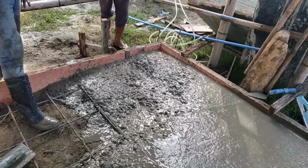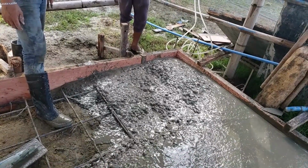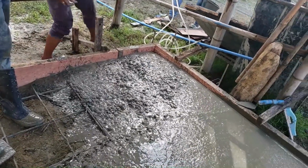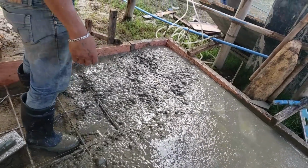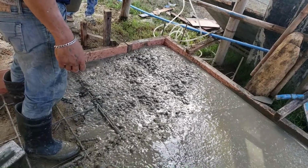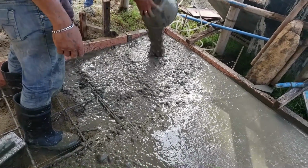It grows crystals inside, microscopic crystals. And too much water, it will not grow the crystals. And it makes a weak concrete that breaks. If you took cement and put it under a microscope, you'll watch it start growing crystals inside, just like fiberglass. But only will they grow big and strong if there's not too much water.